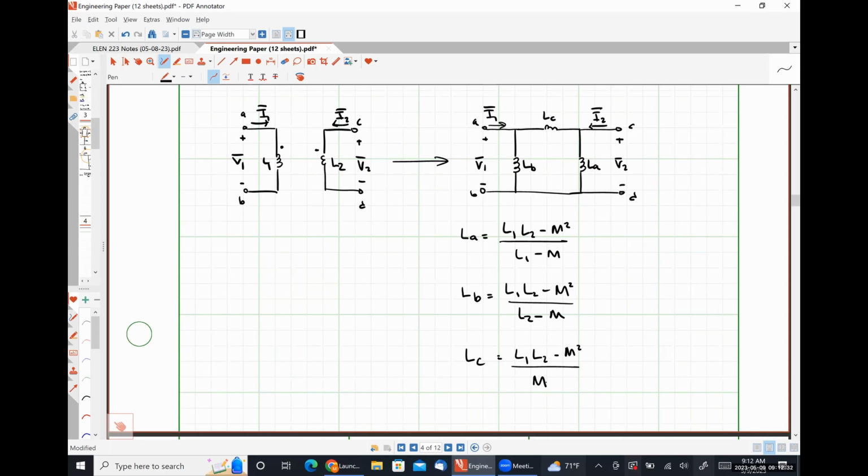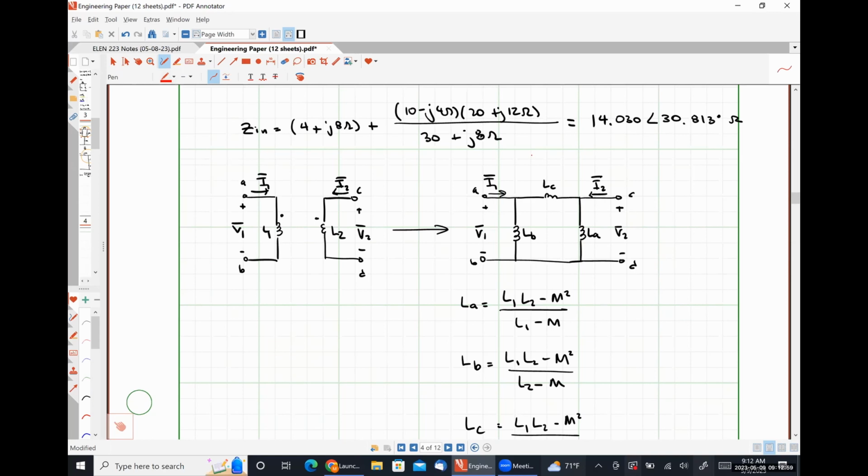So effectively, the delta Y transformation that we developed at this point a month and a half ago for three-phase circuits could absolutely be used to transform this thing as well, giving us these results. And using that transformation is way easier than deriving it like we did the other one. So these are the results. All right, so these are two different equivalent circuits that we could use. My personal preference is definitely the T model because it's a little bit easier to use and it's the one that we're going to wind up using the most, but the pi model might be appropriate in some particular situations.